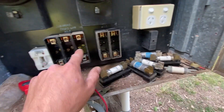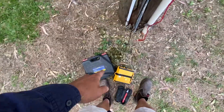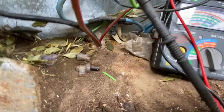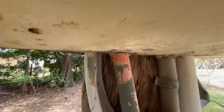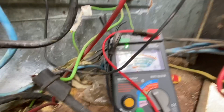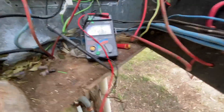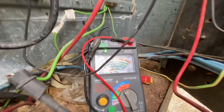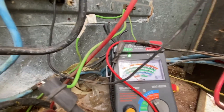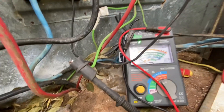Okay, this is an interesting one - all these fuses are blowing and they keep blowing on this customer. I'm going to test the underground cables and check out the readings. I've just got it between earth - so this is the neutral, this is the sub mains. How dodgy is that, it's just sticking out in the board. Neutral to earth - dead short. Let's try the two actives - there we go, one active dead short, the other one dead short. Something catastrophic has happened to this underground cable.